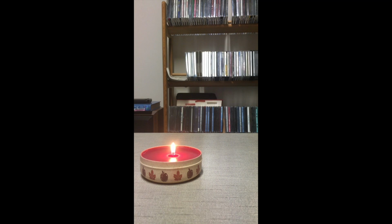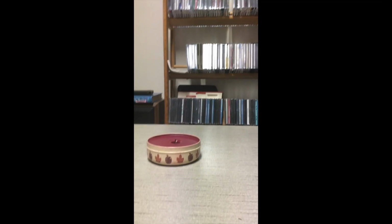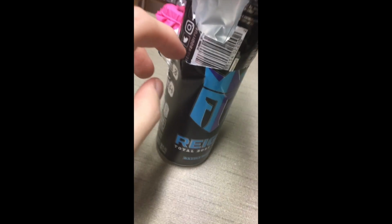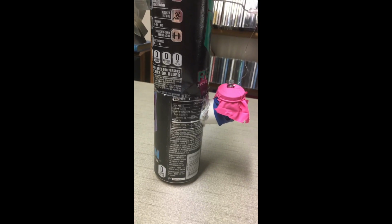Like I said, because the displacer's not quite right, and because of the internal friction, and because even like an hour ago, before that piece broke, when this was more of a solid construction, it wasn't burning it that bad, but the displacer wasn't getting enough movement up and down in order to actually move the crankshaft.